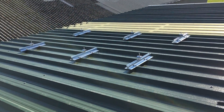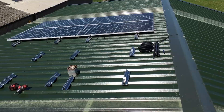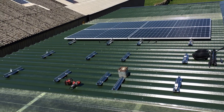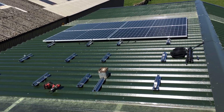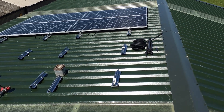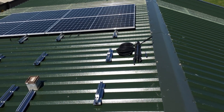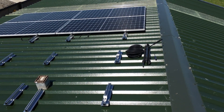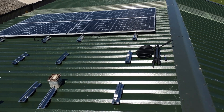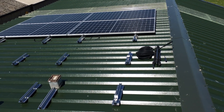Just a few more rows of these to go. So I've got the solar rails all on the roof now and I've got half the panels on. What I'm going to do now is put some plastic conduit through the ridge of the roof and then feed it down to where the solar inverters are, so when I come to couple up the cables they are protected.